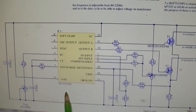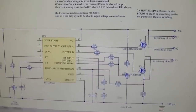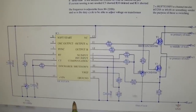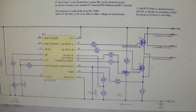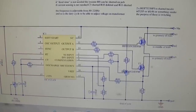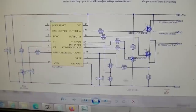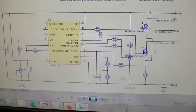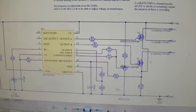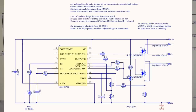I am familiar with this chip - this would be a better option for a 12 volt radio or a 12 volt conversion, because then you could just crank the PWM down lower to get your proper output voltage, reduce it down to whatever, 30 or 40 percent. We should try this in a future video - change all the tubes to 12 volt filament tubes and go with a PWM. You could probably set this up with feedback so it would be self-regulating. Thanks to everybody who took the time to email me different schematics.